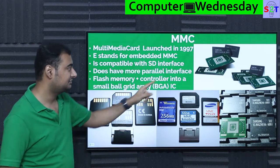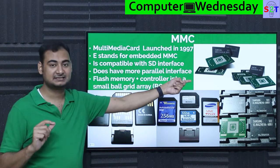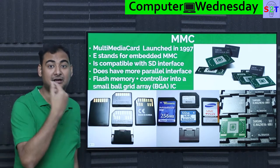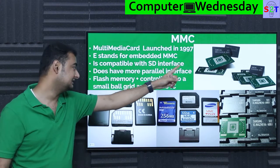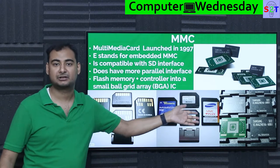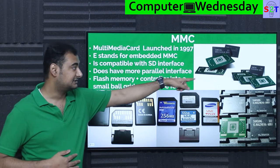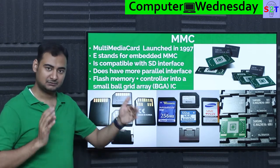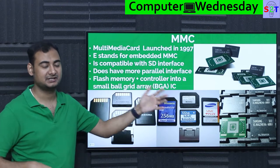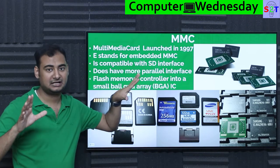When you talk about EMMC, you are talking about this chip. Even though it looks like one chip, it has multiple things inside it. First is flash memory — but do not think this is just flash memory. It has flash memory plus the controller in it. Just like an SSD has multiple flash chips, a DRAM module, power driver module, and then the controller — all of that is put inside one package. They are generally packaged in what is called a ball grid array, because it's inherently small and you'd never find a pin array system for it. That's the IC package you can order from companies and put in your Raspberry Pi, Chromebooks, or cheap mobile phones.